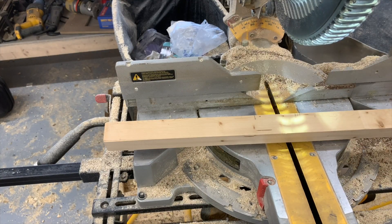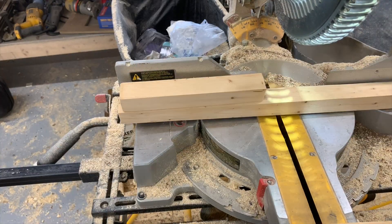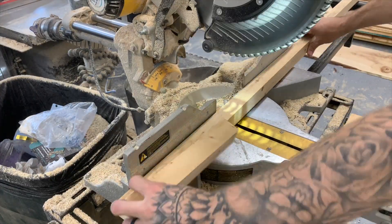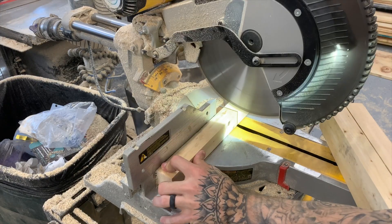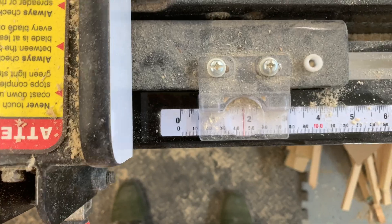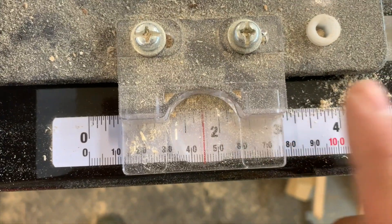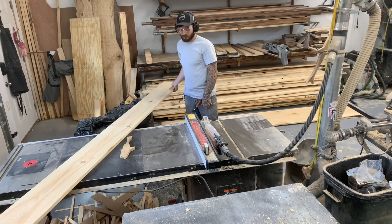This is a two by two from Home Depot. We're going to cut five of these at ten and a quarter. One of them will actually be trimmed shorter for a middle support piece. I slid this to an inch and three quarters, but for the medium feeder, an inch and five eighths would actually be a better measurement. The slots were a little tighter than I wanted, and I'll make the adjustment to the plans.